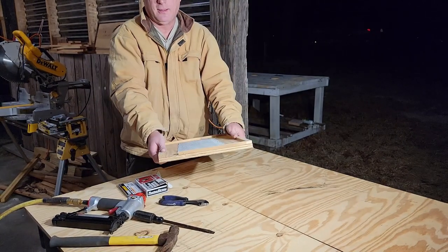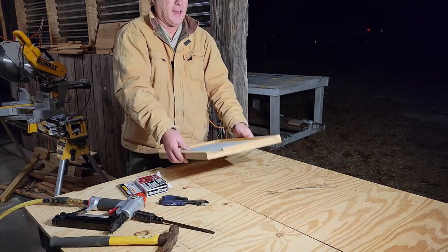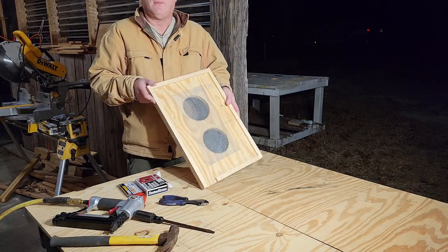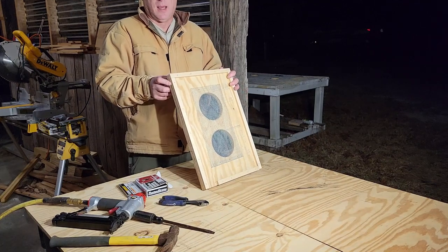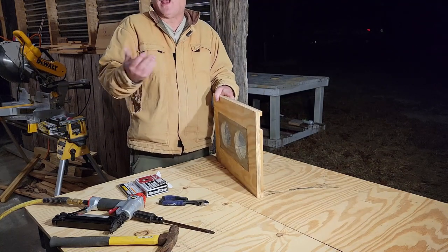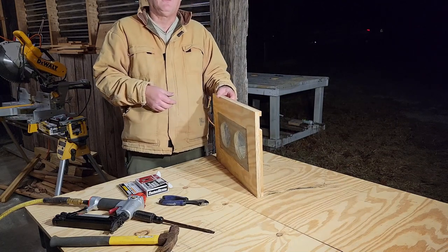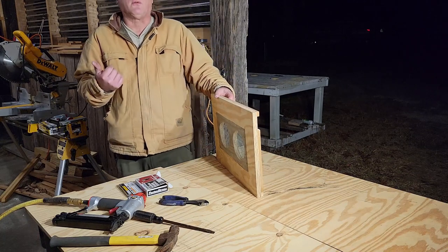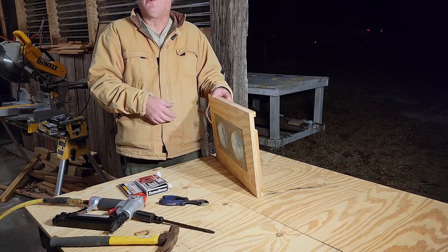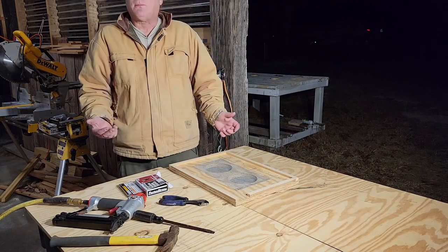All right, so now I've got that staple where it shot off and it went at an angle, not a big deal. It's out of my way now. And then when I paint the outside edges of this, it's going to be nice and smooth. And I'll paint it with a latex base wood paint. Ideally you can use exterior paint on the outside edges, but you could use interior. I've used interior paint. But the difference is exterior paint has a mildew preventative in it, whereas the interior doesn't. So you may at some point get mildew in the paint. The bees don't care.